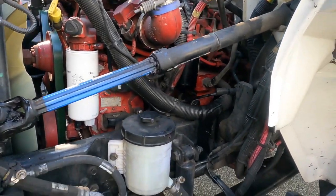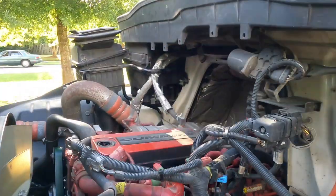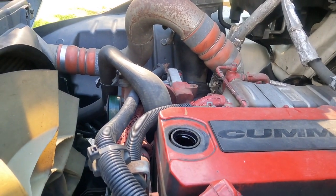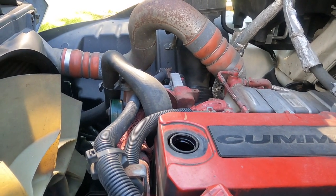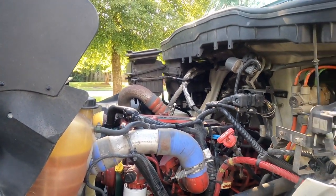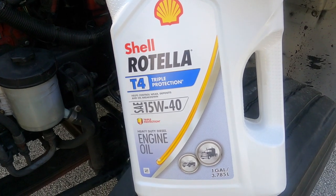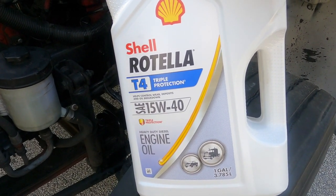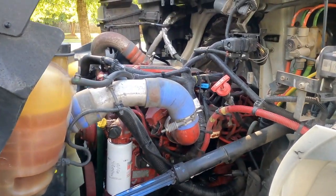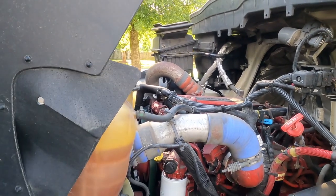As you can see, we got both filters in place now - nice and cleaned up, nice and tight. We're going to go ahead and put in four gallons of 15W40 oil - triple protection. If you're not sure what you need, I went in and just told them I want everything to change the oil and the fuel filters, and they looked it up by VIN number and gave me everything I need. It's exactly four gallons - that's what we took out of it. We're gonna go ahead and fill this up. We'll show you the crank-up after we finish.